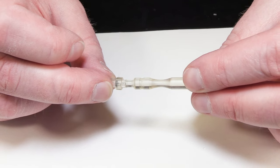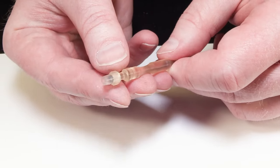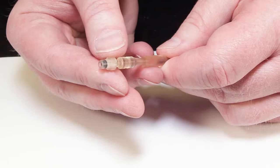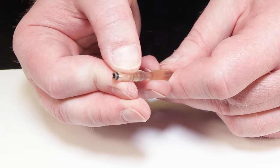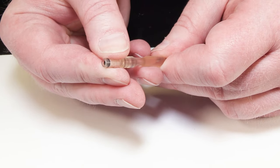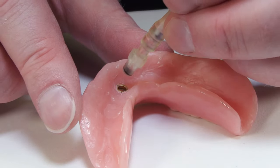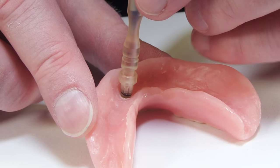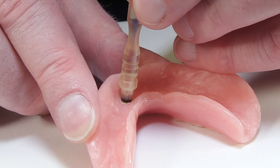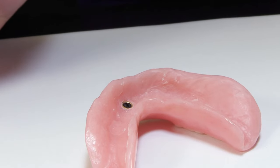With the O-ring in place, use the tool to push the O-ring farther into the tip by slowly rotating the tool while applying gentle pressure. Make sure that the O-ring doesn't turn sideways in the tip so that it stays in the same orientation. Once the O-ring has been pushed far enough that it's just about to protrude out the other end, center the tip on the housing and push down on the tool, which will force the O-ring out of the tip and into the housing. This can be a little tricky the first few times you try it, but if you don't succeed the first time, just place the O-ring back in the tip and repeat the process.